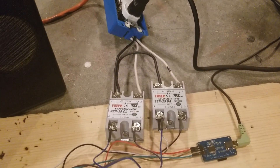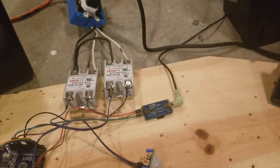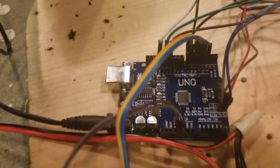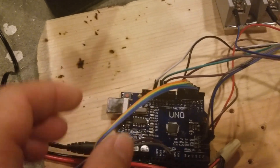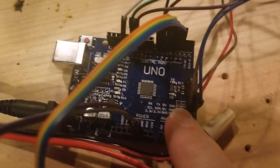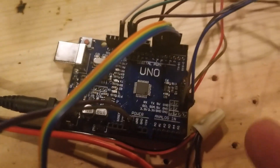Right now they come on at the same time, but they could be running separately. My plan is to use LEDs to actually light up the prop, and then turn off the lighting around the rest of the area so it will light up just the zombie. You're going to download the software at ButtonBanger.com for the Octo Banger, and he's got some pretty good diagrams on there. Basically the UNO program you download will tell this UNO board what all these slots — these pins — are supposed to do.